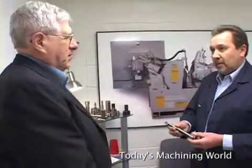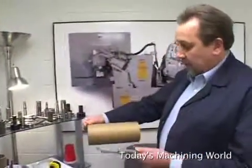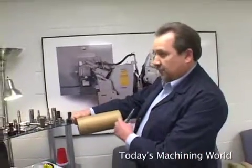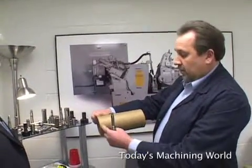Now, my ignorance. Define dressing the wheel. Well, you're forming the wheel. So you're taking a diamond. If this was a grinding wheel, you would be passing a diamond across the surface of it, and in this particular case, you would be putting this shape into the wheel.